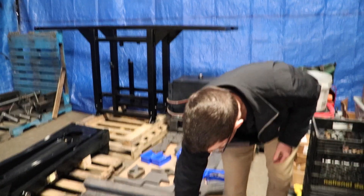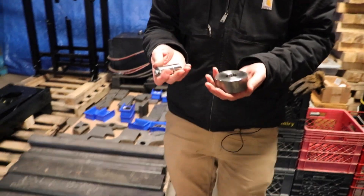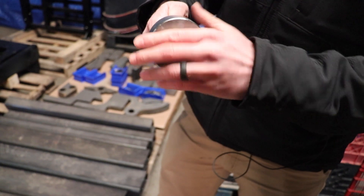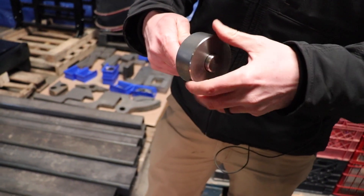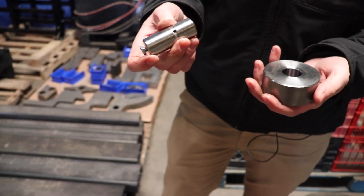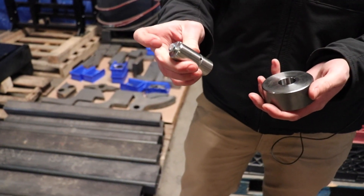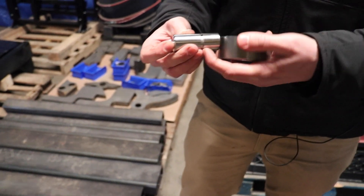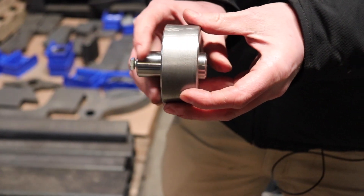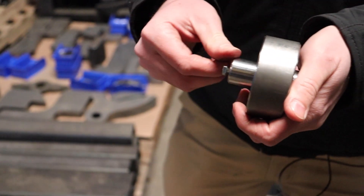Another process that we use besides regular factory lengths and laser cut parts is machined steel. These are the internal rollers that stick up just above the surface of the rail on our trashcat to allow the dumpster to ride up and down the rails nicely. These are two custom parts that we have machined here in southern Pennsylvania — a high grade steel alloy with a hole for a grease zerk and a groove to retain the grease. A hole gets cut in the top of the rail, the roller gets slid up in, the axle inserted, and then fully welded to the rail.